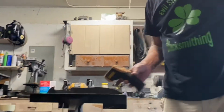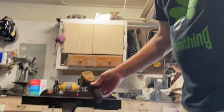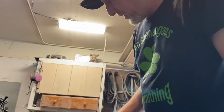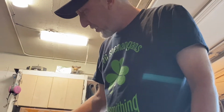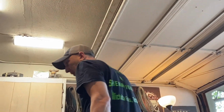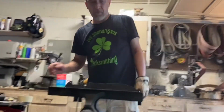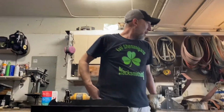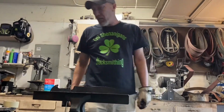Alright, so the next thing we do is we'll quench it. Basically, we're going to do the same thing. We'll bring it up to about 1500 degrees, and we're going to quench it in the AAA. Leave it in there long enough for it to cool. Don't just plunge it and take it right back out. Number one, you'll get a big fireball that way.